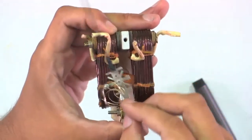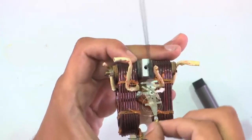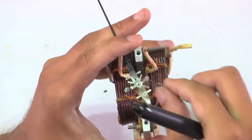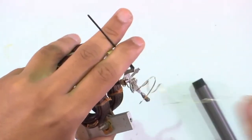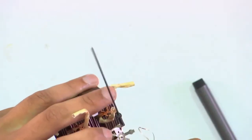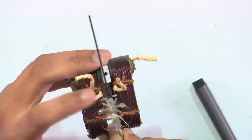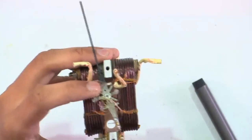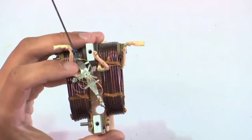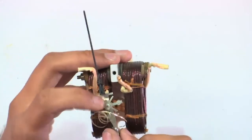This long needle-like thing is the pointer. As this coil moves, the pointer will move along a scale. Again, this is the spring which is broken — it was attached to the frame of the instrument, and the spring tries to hold this moving coil at its normal position or tries to oppose the motion of the moving coil. I hope this short video will help you in having a better visualization of the instruments which I was trying to draw, and it will also probably help you in understanding the instruments better. Thank you for watching.